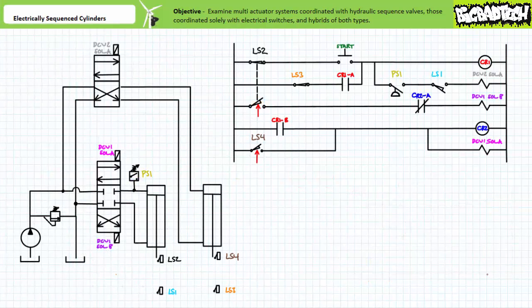For this reason, consider this substantially upgraded electrically sequenced clamp and bend system. Note the absence of a sequence valve in the primary hydraulic system and the presence of an additional directional control valve. The responsibility of sequencing this multi-actuator system now belongs solely to the ladder logic diagram, using not only a pressure switch but also limit switches in both the clamp and bend cylinders. Note the de-energized start state of this system assumes both the clamp and bend cylinders are fully retracted, so we should expect both limit switch 2 — at the limits of clamp cylinder retraction — and limit switch 4 — at the limits of bend cylinder retraction — to be held in their activated opposite states.